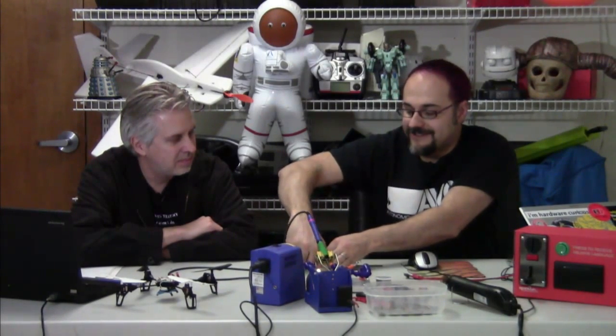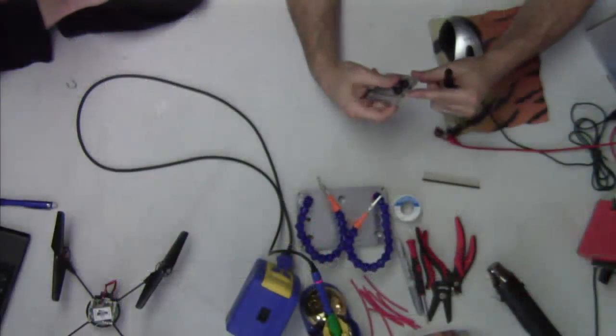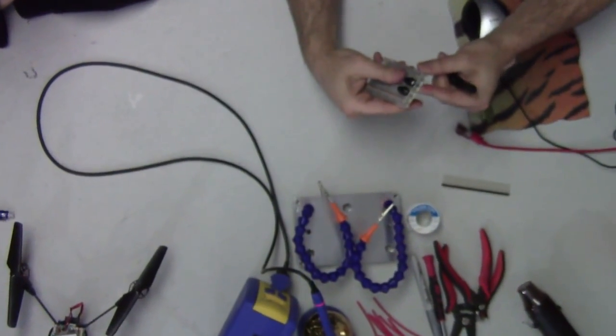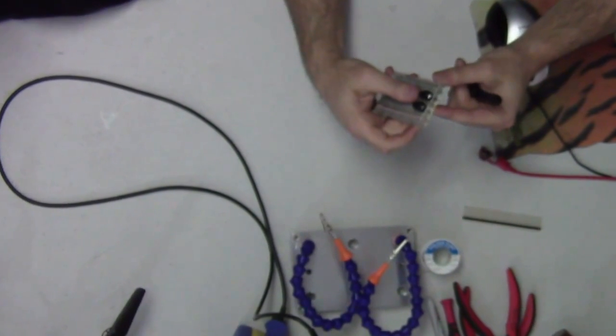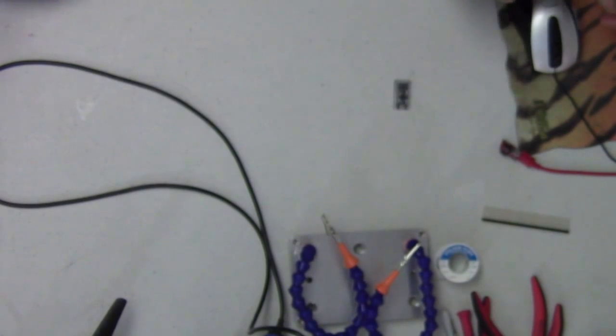You can see I've got this guy in here and it's pretty hard to get in and out. The other thing I did was take a standard black Sharpie and write on the box the voltages I expect to plug into each barrel jack, so I don't get confused. In particular, if you were to plug the 12 volt power supply into the supply for the printer, you might actually damage the printer, so be careful of that.